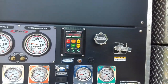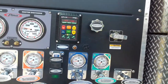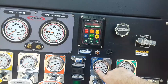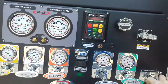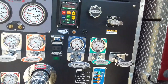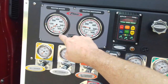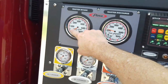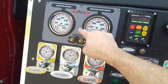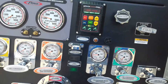That's the difference with modern trucks — they're all controlled by the computer, just like the engine; the pump and the controls are as well. This protects the guys out on the hoses by not putting too much pressure on them. It also protects the pump — if you start to exceed pump capacity and cavitate the lines, it will shut down. If another truck was pumping into me, that pressure would be added and this would go up as well. So if he was pumping into me at 20 PSI, it would add 20 PSI unless I backed off the throttle — the truck does that automatically.